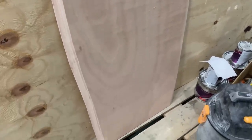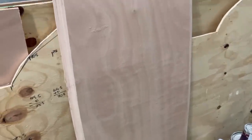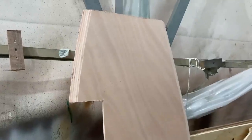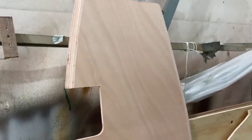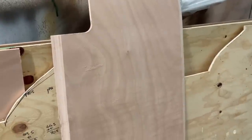What you can see here is the new cabin sole — I've cut that out using the templating you saw, and then beveled the edges so these edges here will butt up against the side of the hull. I'm just about to take it upstairs and give it a trial fit — I'm expecting it'll need a bit more of a tickle to make it fit, but once it's up there I can mark on it where the bearers are going to be because I'm going to drill holes for screwing it down, and also mark where I need to cut the two bilge access hatches.